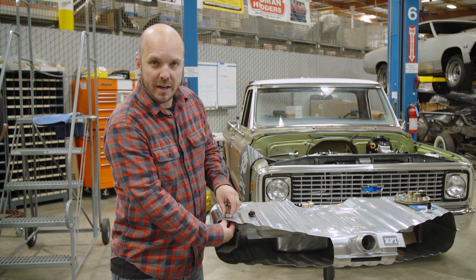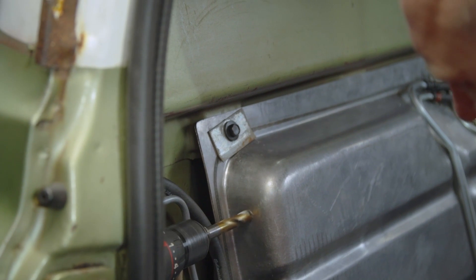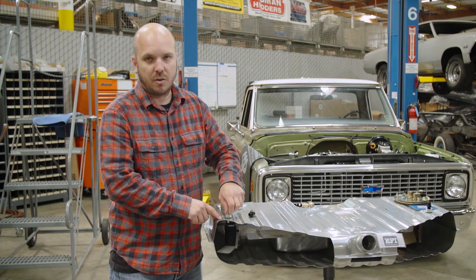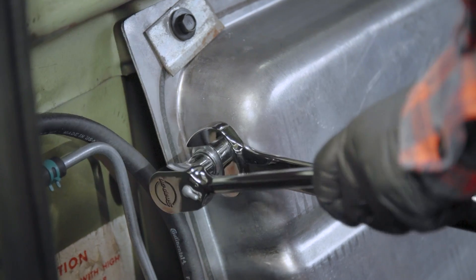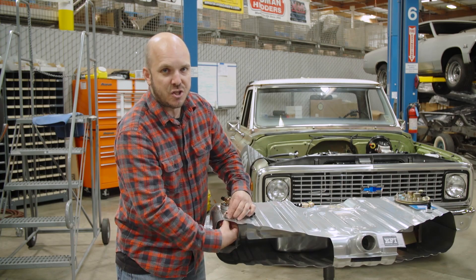This fitting is all made out of aluminum. It's got a half-inch shaft. You drill a half-inch hole in your tank on any flat surface, you slide it through, and you start running this bolt down. You're going to hold this with another wrench — that takes a one-inch wrench — and you're going to tighten this bolt. It's going to get really snug, and what happens is this shaft starts to deform and it fills the hole.